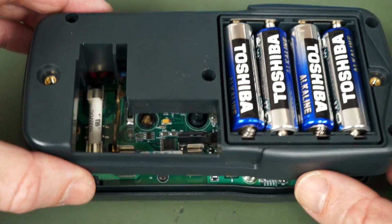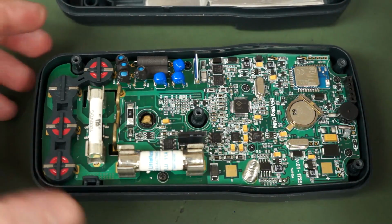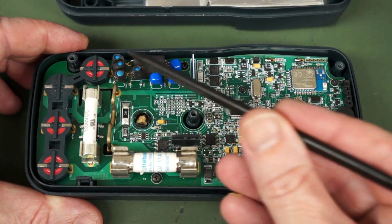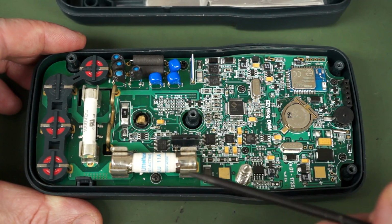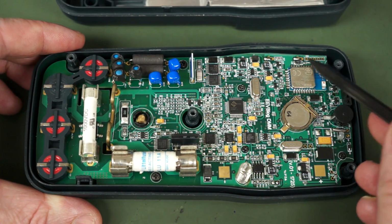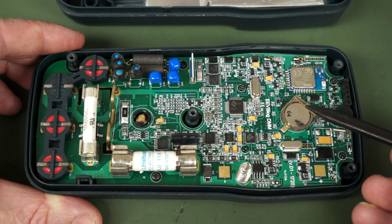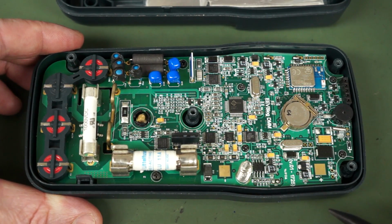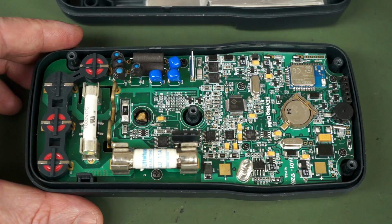And I know you want to see inside, so let's check it out here. No wiring, it's all shielded with the spring terminals, everything else. We've got a Hycon HY3131 chipset here. We've got all the requisite PTC and MOV input protection, of course the big HRC fuses, and we've got a Blue Giga Bluetooth module here with its own programming header over here, and this programming header here is for the ARM ST Micro. It's a 32-bit ARM micro. That's on the bottom side of the PCB under here. Battery backup for the real-time clock, true RMS converter chip from Analog Devices, and all the requisite stuff.